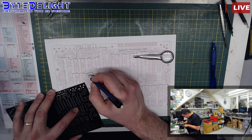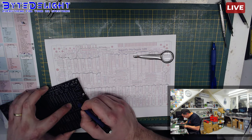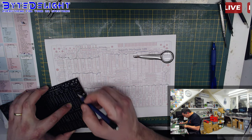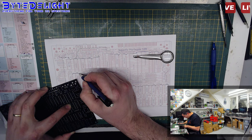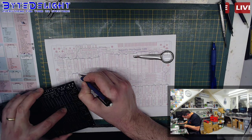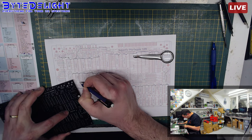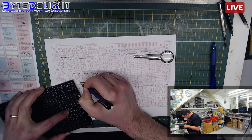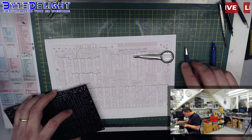And here we can see a track going down. Not up, but down. I can see the track going up here. So that's what we need to find out in a minute. But first, because I'm here already, let me check where this one is going. So it's going to the inside, then it's going down only to the last pin here, and then it's going down again to that one. So this is a connection between those two nets.